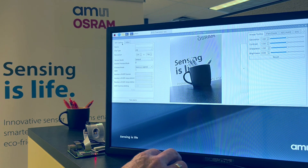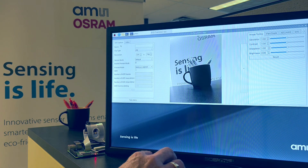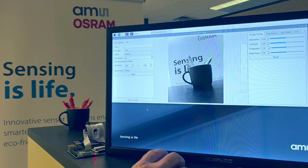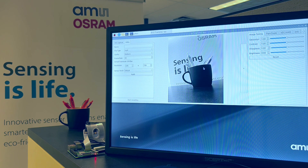On the left side of the GUI there is a still capture tab — I can take a photo, and then go to /home/pi and the photo will be right there. I can also take a video: going to the video tab, this is going to record a file in MP4 format. So it's recording now — I could go do different things and then stop my recording, and that will also be saved in /home/pi. We invite you to write your own applications using the Pi Camera 2 library and come up with your own image processing algorithms. Thank you for your interest in AMS OSRAM and in the Mira 050 Image Sensor Evaluation Kit.